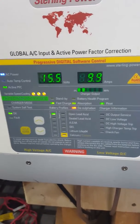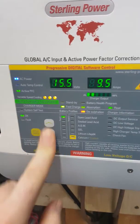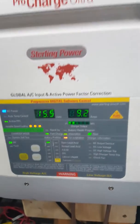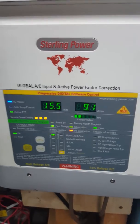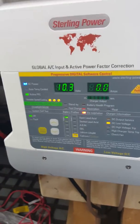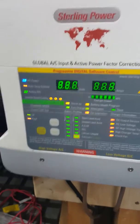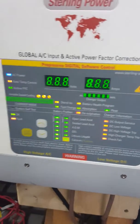I've just had a look at how to disable desulfation if you want to. These buttons seem to be unresponsive now — they don't do anything. So to turn off desulfation, just remove the AC going into it. It will stay on for 240 minutes, but if you turn the AC off, it turns the unit off altogether and then fires it back up again in open lead acid mode rather than desulfation mode.